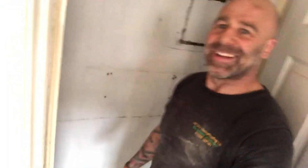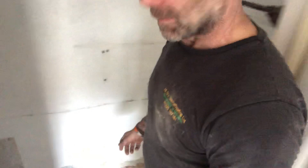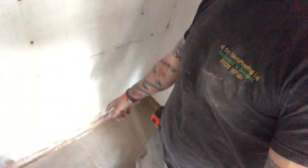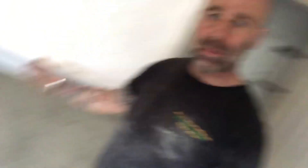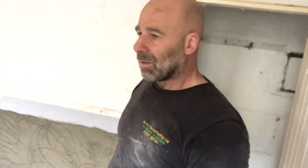So I'm just going to show it inside. After breaking all the customer's stuff — look at that, the double door opens to there. So we're bridging down here with touching flags. We've hacked it off around there, drilled a damp course in to stop any damp coming up. We've hacked off below floor level because it's a solid floor on this side, so it doesn't need to be plastered down below floor on the other side — else it bridges. So we've hacked it off above floor level and there's a damp course gone in there, and that'll dry out.